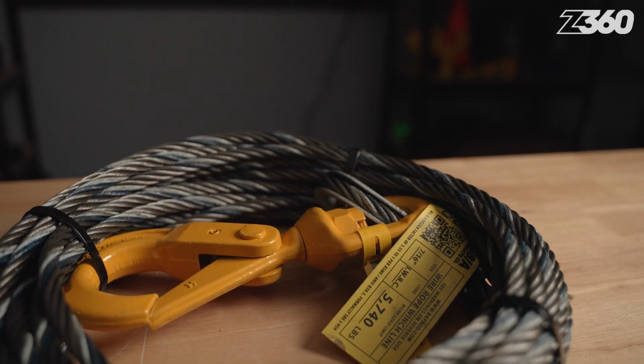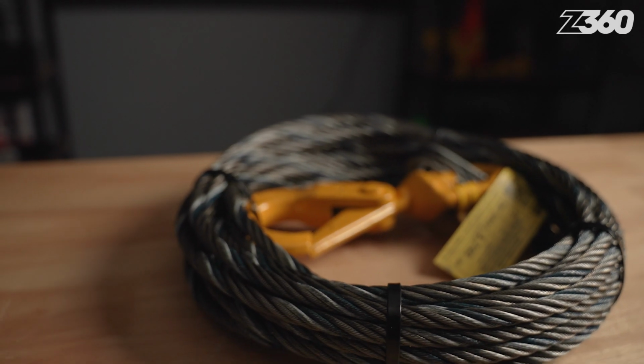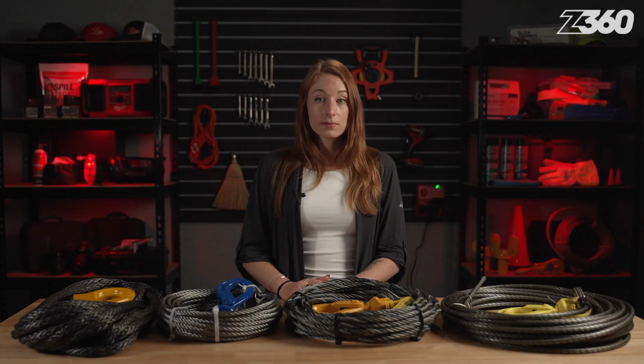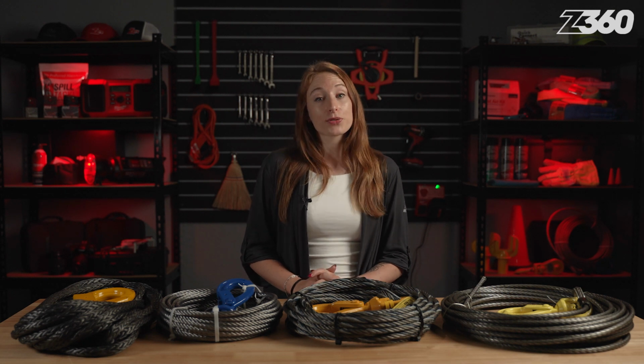Next, steel core wire rope is also made with extra improved plow steel, which provides superior strength and flexibility. Not as flexible as the fiber core, but the steel core offers greater crush resistance and a higher nominal strength.